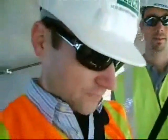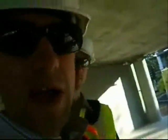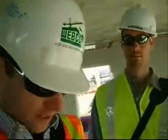The one thing I wanted to look at and show you here is actually the elevation view. We don't just provide plan views of the walls — we also provide elevation views of the walls. Here we're looking at that same shear wall that we have standing right in front of us, as if we were looking at the face of the wall. You can see we're pointing out vertical reinforcement, and we've got the mat foundation that we're standing on top of right now.